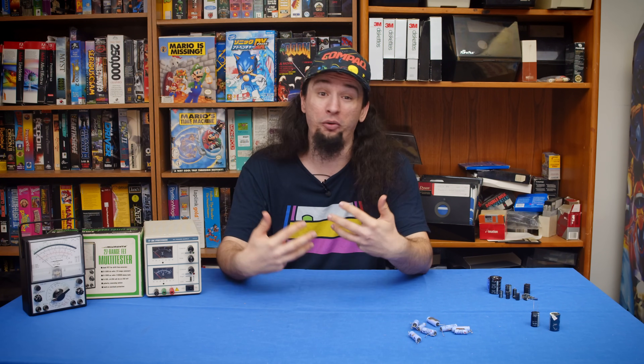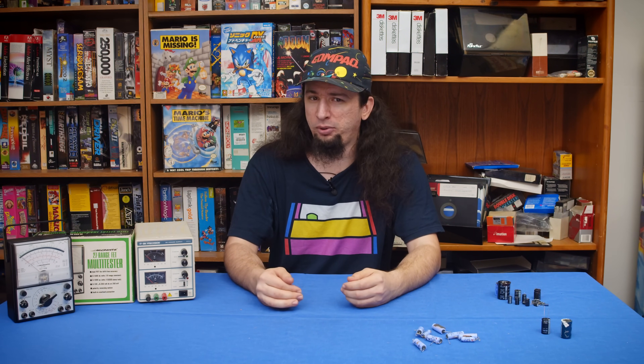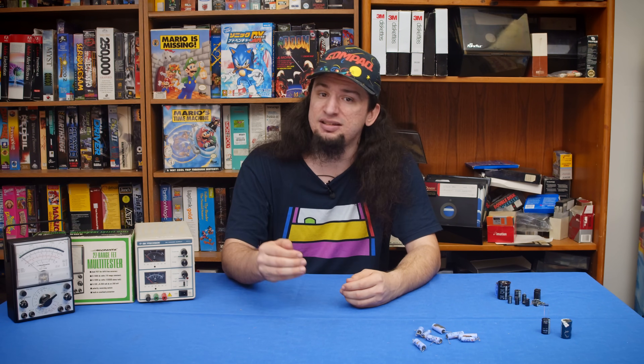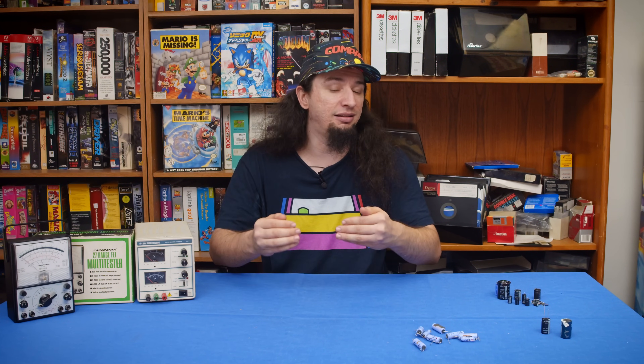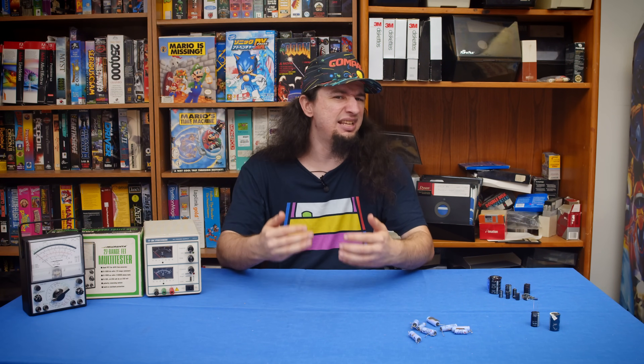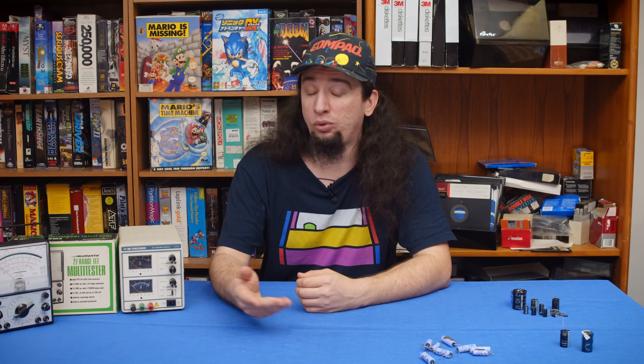Self-healing can also be called reforming, as it's the same process as when capacitors were initially constructed. The higher the temperature a capacitor operates at, the more quickly the oxide will decay because the chemical processes are accelerated. The expected lifetime of a capacitor is therefore the time it will take for the electrolyte to be depleted at the operating temperature. As the electrolyte is depleted, it will lose conductivity, and as it is the cathode side of the capacitor, the overall capacitance will go down. If the cap is left running like this, it will eventually destabilize the circuit it is in, or it may fail short as the oxide is no longer being rebuilt.